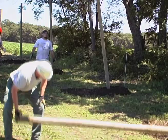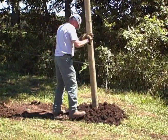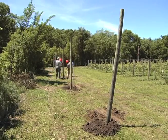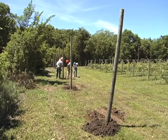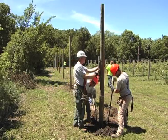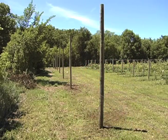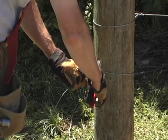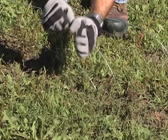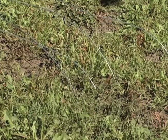When you're installing them, rotate any curved posts so that they stay within the plane of the fence, preserving the fence line. All of the posts should stand plumb just inside the guide wire. It is important that the guide wire is not pushed out of line by a post or anything else. Once you've placed all the posts in the fence line, remove the guide wire and set it outside the perimeter of the mowed fence area. Poke both ends into the ground to keep it from coiling up — you'll use this wire as a top wire later.